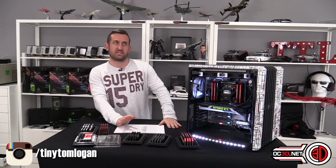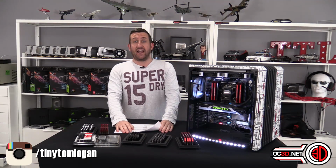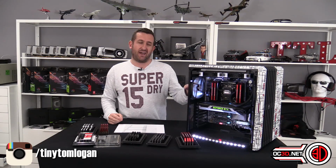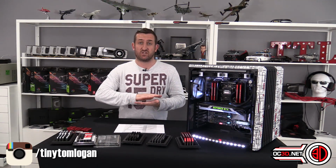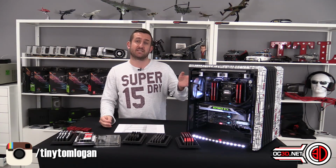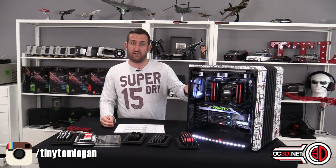When we moved on to performance and the like, it's a workstation board, so you wouldn't necessarily think that it was going to be an amazing overclocker. Well, I didn't, but it actually was. This is the first of the X99 boards that I've had. Maybe I've been a bit braver in certain points of the voltages, I don't know. But maybe it's just the fact that the BIOS code is advancing across the range of the Asus boards. It's the first time I've got 4.5 gigahertz properly stable on my 6950X.